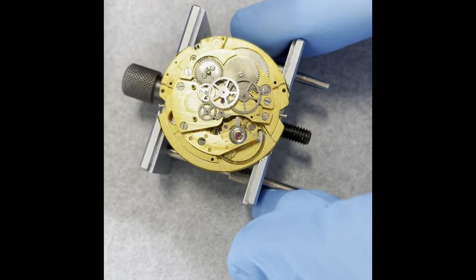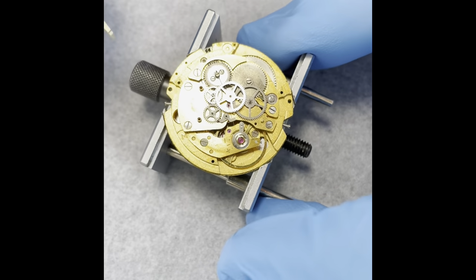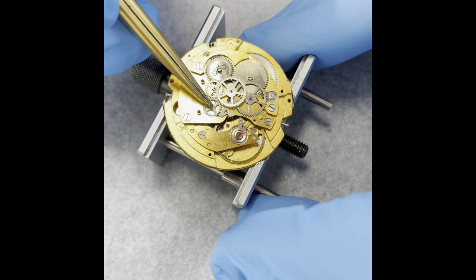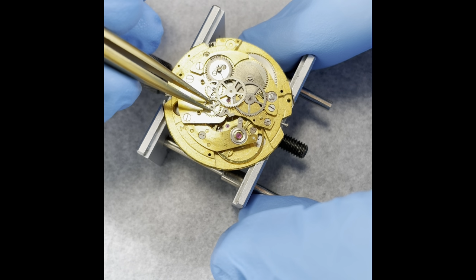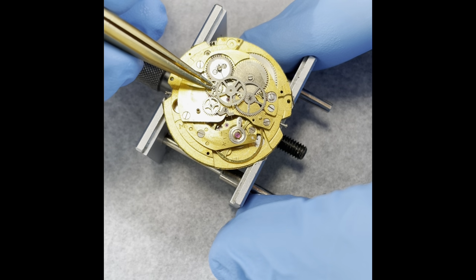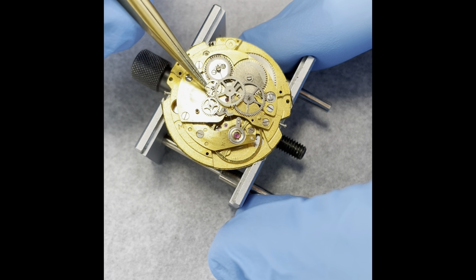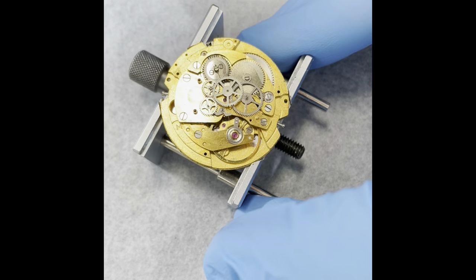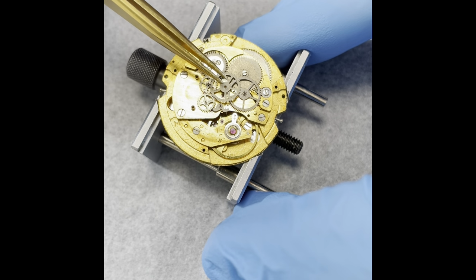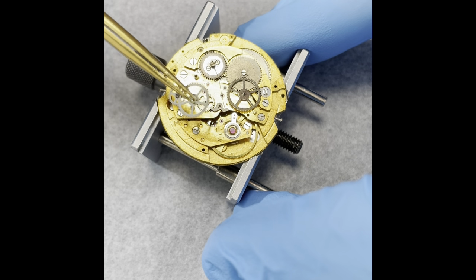So there's no reverser wheels in this movement. You just have everything kind of gear train based. So you have, there's your locking wheel, there's the winding wheel, and this of course engages with the wheel with the saw on the other side. So quite a nifty little construction.